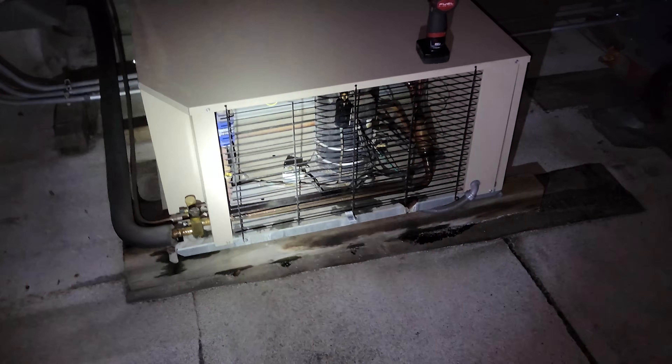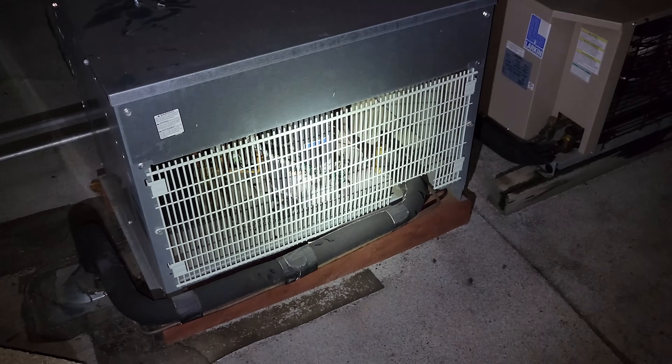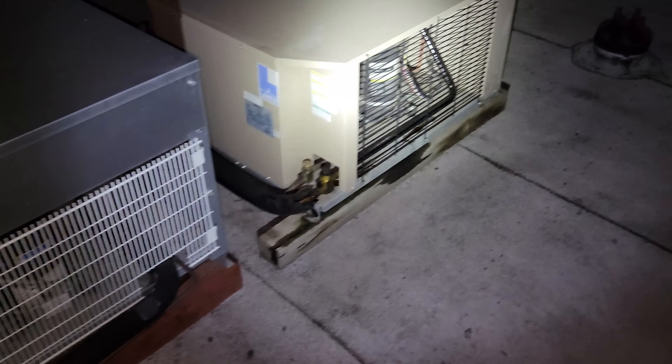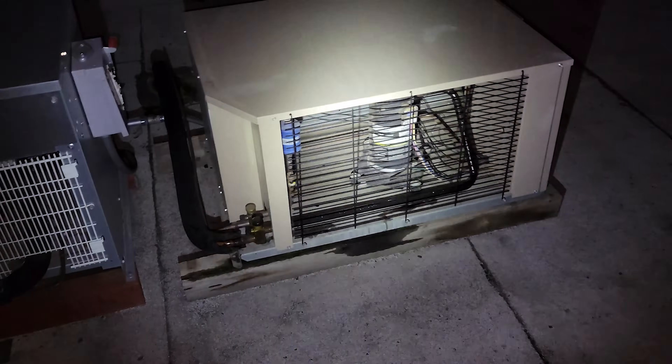I don't know if it was a loose connection that caused the transformer failure — it's possible. But we're definitely going to follow up on this one. I'm going to let the equipment run. I checked on their walk-in cooler just because I was curious, and the evaporator is really dirty. So they're not going to get a choice — we're going to clean that evaporator too, because I don't need that to be another emergency service call.